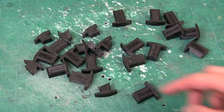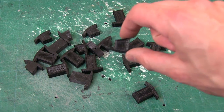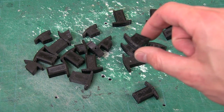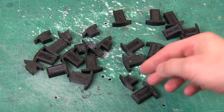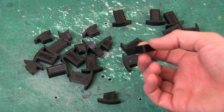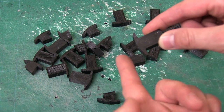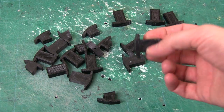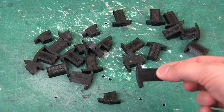Here they are — I've made these wedges which are to go on the fingertips, although I was thinking about actually 3D printing the fingertips because it's going to be quite hard to make the actual end of the finger with a round on it out of sheet material, so I may well 3D print those. I've also got these other parts which go on the back of each digit, and that allows me to wrap some sheet material round between the loop on the front and these on the back. All of these are printed in ABS so I can solvent weld them on with acetone to the original pieces.